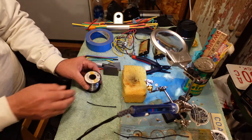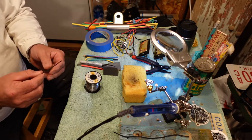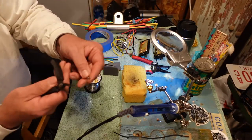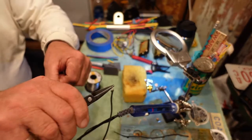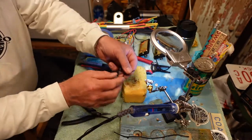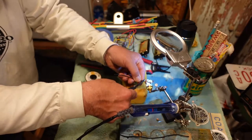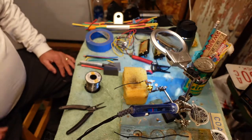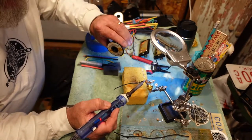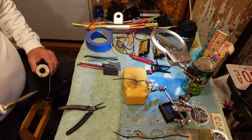Don't buy fake sponges — they have a weird scent that comes off them, some petrochemical-based something that's not good for your lungs. When you're going to do a connection, this is pushback wire — I can take these little pliers and just pull back, push back. I just want to put a little kink in the wire like that, then figure out which way I'm coming. I really don't want this moving around, so squeezing that down and getting it right is really important. Then it's just a matter of touching the iron to the metal first — don't try to put the solder on the soldering iron and expect it to go on the part. And there you go — it's that easy.